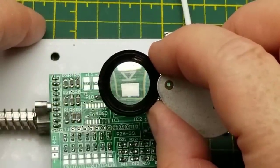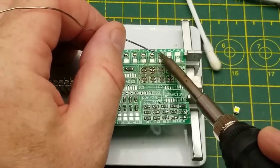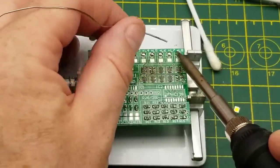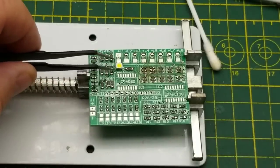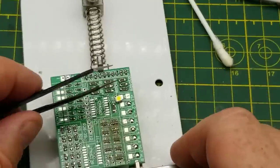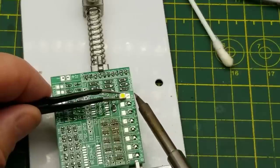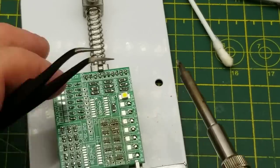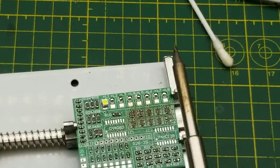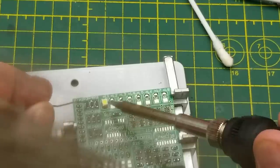So the side with the little angled bit cut out goes to the bottom. I'm hoping these are going to be the easiest pieces to solder on here so far because they are the biggest ones - normally I'd start with the biggest ones but since these are semiconductors I didn't want to destroy them when I was still not practiced. Okay, it's in place - get the second side just since I'm in the neighborhood and then I'll bang through the rest of them. That actually looks reasonable - moderately pleased with that joint.